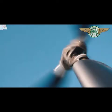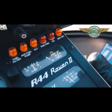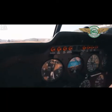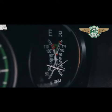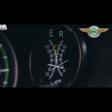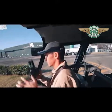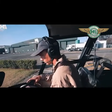Your helicopter should be running between 50-60% engine RPM and your starter light is off. Rotor blades turning within 5 seconds. Oil pressure is in the green. After some time your clutch light will go out. You can run up your engine to 70% RPM for the warm-up. Place your headset on and check for a tight fit around your ears, with your microphone placed close to your mouth for clear communication.